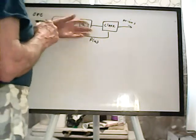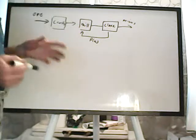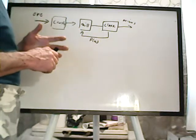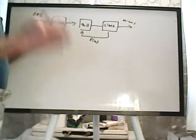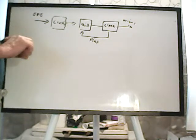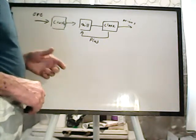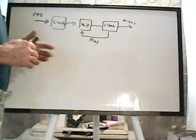Now, all of this, in terms of what's the smart thing to do, depends on the mineralogy, the extraction process, and things like that. And the only way to find out how well it's going to work is to test it. Now, we did the leaching stuff on my impact mill material. We didn't do a whole lot of classification except to know it's a pretty good fine grind. So that's pretty much a done deal. That's what that machine does.